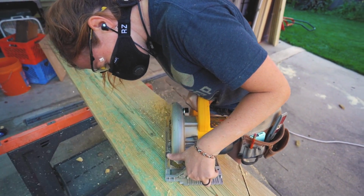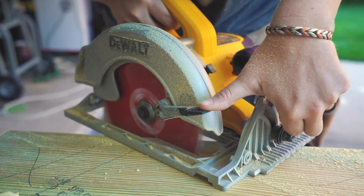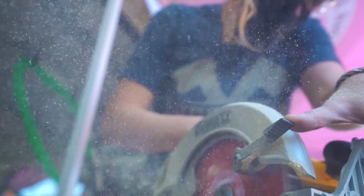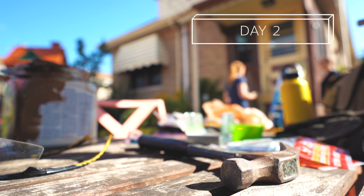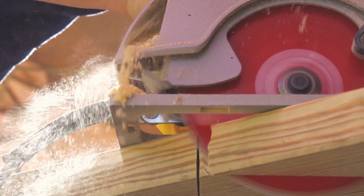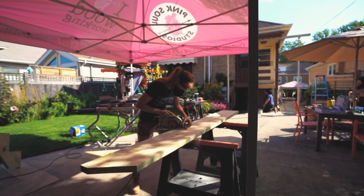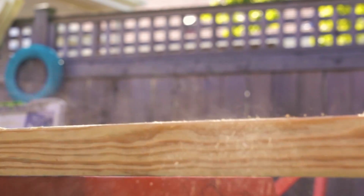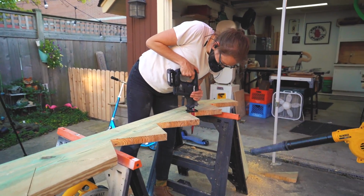The goal is to have all of the steps the same. It's really funny how easily a body can tell when a step is off from the others. But it also creates a hazard if they are off, so it's more than just an aesthetics thing. You can see that it's being cut from treated 2x12. Some people will overcut their line here in order to make the cutting go quicker, but the better way is to cut up to your line in both directions, then come back with a jigsaw or a Sawzall to complete the cut and drop the part.